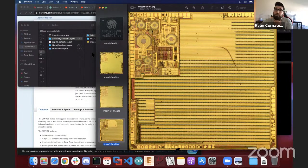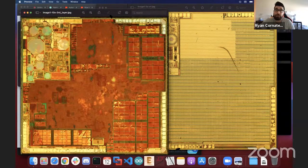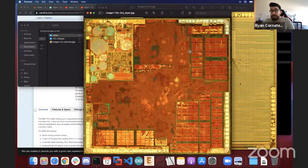So I put it back in hydrofluoric acid for around 30 minutes. 30 minutes into it, I start to see some red markings on it. I didn't really think anything of it until another 30 minutes later inside the hydrofluoric acid, which caused it to look like this. The beauty is that we can now see memory blocks. That was cool because even though I knew this was heading towards ultimate failure from way too much exposure to hydrofluoric acid in one sitting without changing the solvent, I knew the memory blocks are here. We can see them and it's delayered, but whatever I delayer past this point is going to be completely ruined.